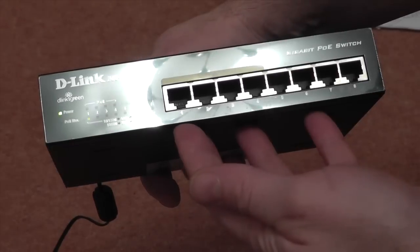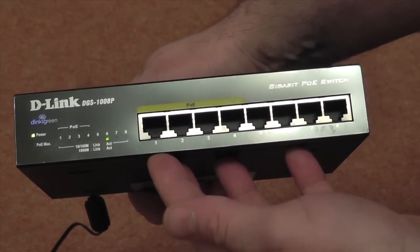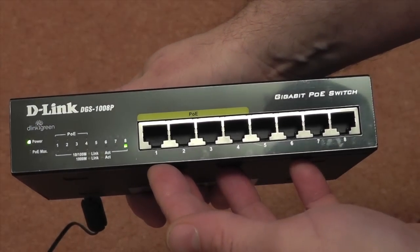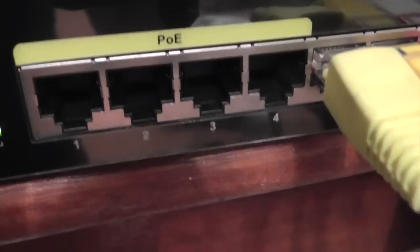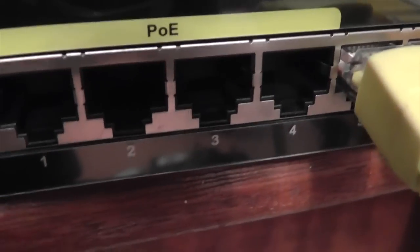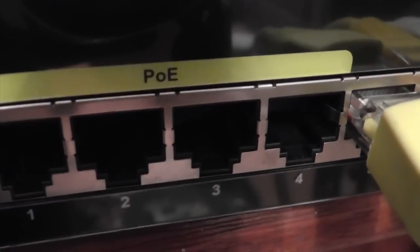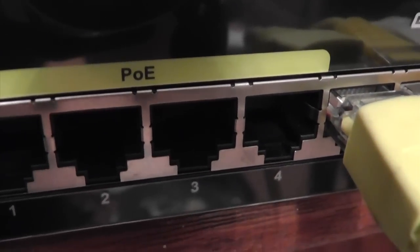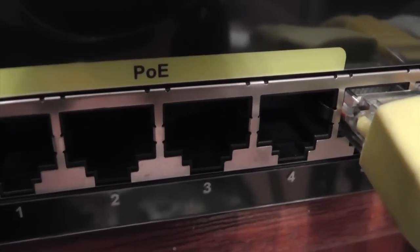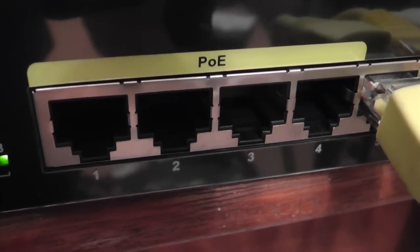Turn it on. That sequence of lights comes through — that'll be testing the ports. The PoE ports, we're not using those just now, but when you're plugging devices in, each of the ports will give about 15.4 watts. So it reckons it's going to give a total of about 52 watts that you can use through that, which is worth bearing in mind depending on what devices you're going to plug into it.